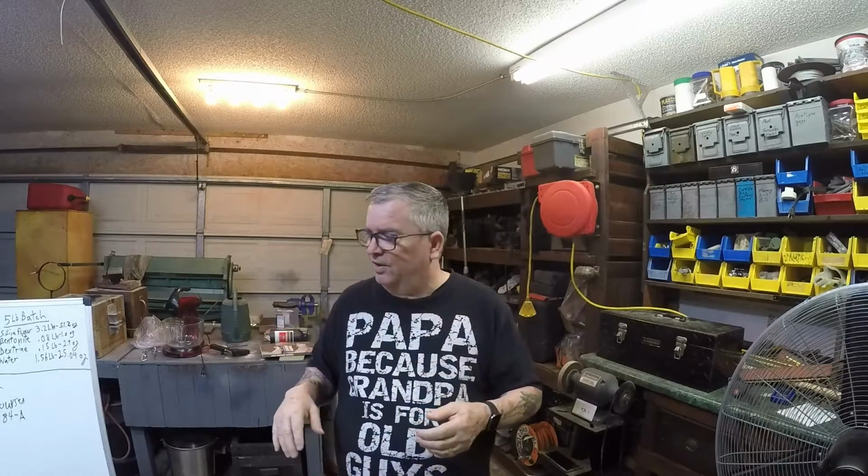But this puts a barrier between your molding sand and your molten metal, and most of the time I saw, the surface was very smooth. Okay, all we had to do then was to grind off the parting line to make it smoother yet, where that flashing came through. They call it flashing, like when the two pieces, I don't have anything to show.